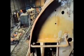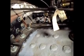And as you can see, it's rusted up a little bit because this is also where we had some more leakage. And some of the copper lines, I think, well, this pipe up here connecting to the turret valve, this one going to the water column inside the cab was leaking, and we had to tighten that up. And after I tightened it up, it trickled down and eventually stopped. So it's pretty tight. I hand tightened it, and I tried to get the wrench around it, and it wasn't big enough, but it stopped anyway. So it might be pretty tight as it is.